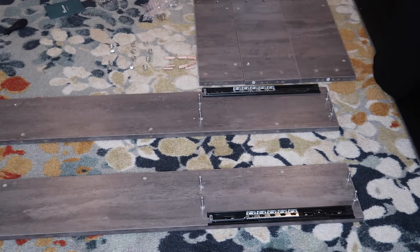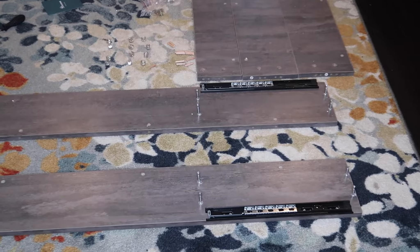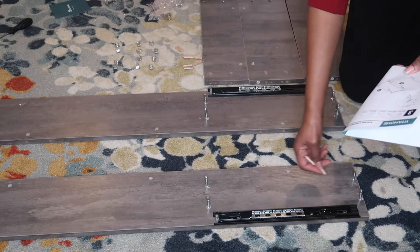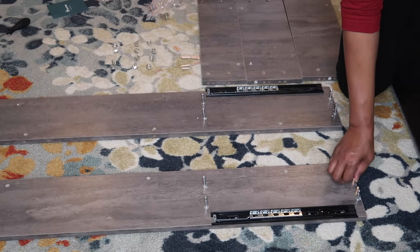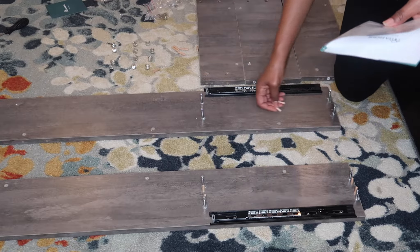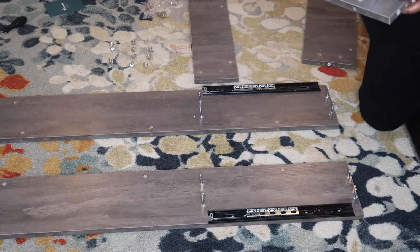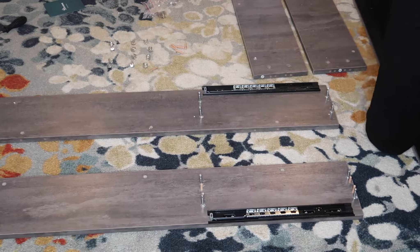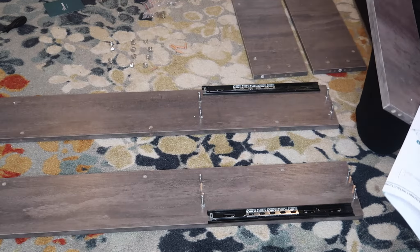I'm going to explain what I'm doing, then fast forward so that you can see the process — we're going to be done with this table pretty shortly. The next thing we're going to do is put these wooden dowels in the places that they go. I usually take all the identical pieces and put them in at the same time; it just makes the process go by faster and smoother. Once I get everything in where it goes, there's going to be some pieces that you slide on top of these pieces that are standing up. One important thing: make sure that piece is the correct letter for the assembly, and make sure you're looking at the pre-drilled holes to make sure they're not flipped and that you have them on the right sides.